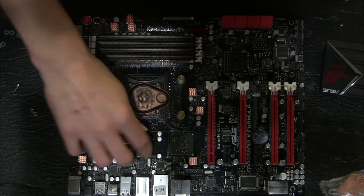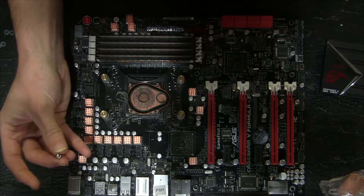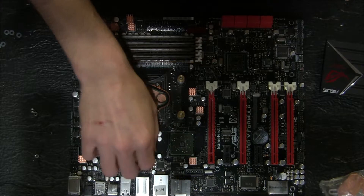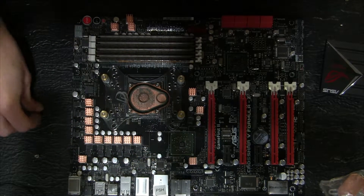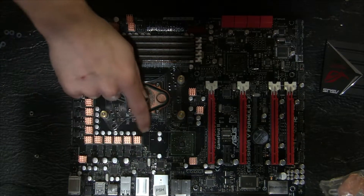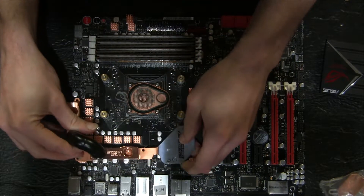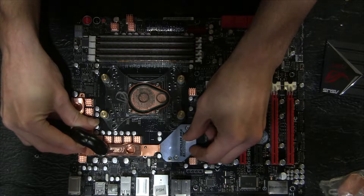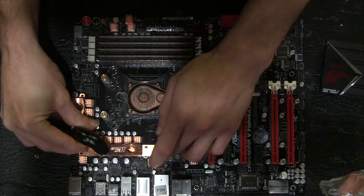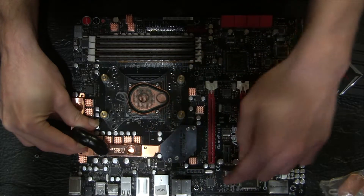I have two bolts right here upside down so they're facing through the bottom of the board. What I did was very loosely tighten a screw on the bottom right here, then take another screw on the top, tighten it up a little bit, and do that for both of them — just let this block rest on top like so. You'll find you'll have enough space that this capacitor will more or less sit there and you'll have a good idea of where your mounting holes are.